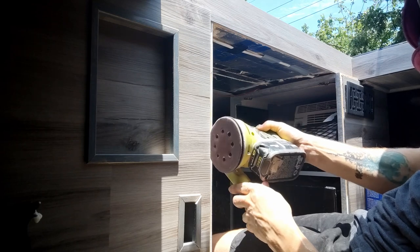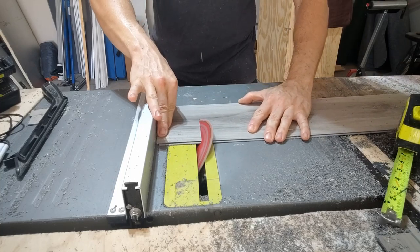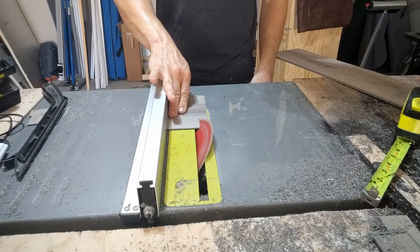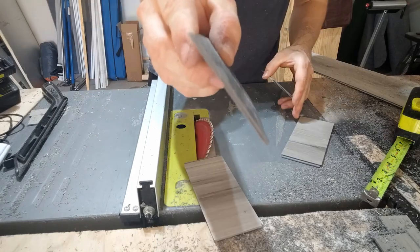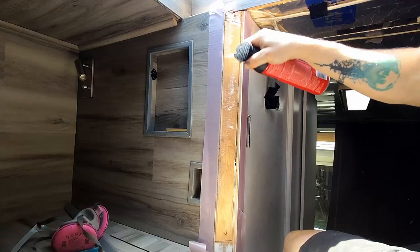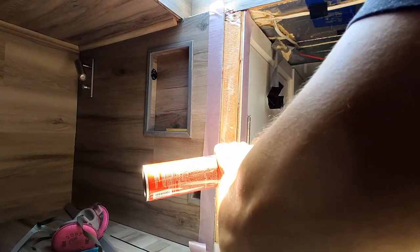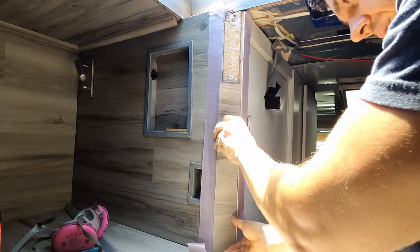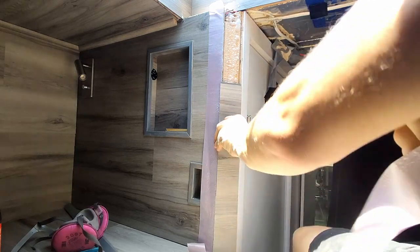This angle wall doohickey, whatever, I don't even know what this would be called, but this has represented quite an intellectual challenge for me. I didn't know how to finish this, but I figured if I could cut it precisely enough, I could simply cut 45 degree angles on either side of the luxury vinyl planks, and as long as they're the right size, it would fit flush, there'd be no gaps. So, turns out that with enough precision, I was able to get it down, and I think it turned out quite well.